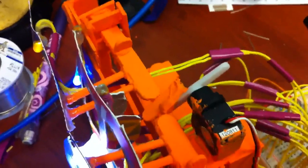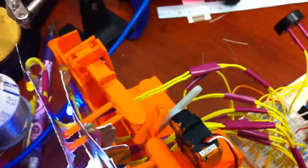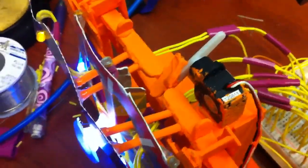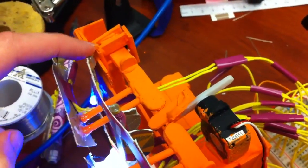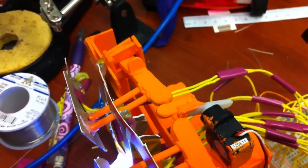For the servo, it controls both eyebrows from just one servo, using a really simple mechanism: there's a coffee stir stick right here which is clasping onto a piece of string, which is also attached to these two angled pieces, and the angled pieces are held up by this little post over here, which allows them to do different angles, and then there are stoppers along the angled pieces to stop them from sliding out too much. So whenever the servo pushes the claspy piece in the middle, it moves the angled pieces either up or down, as you can see. And then I can also control it with the potentiometer.